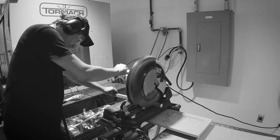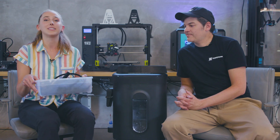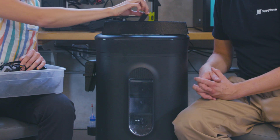As part of our work here at the lab, we produce a lot of prototypes, which means a lot of iterations along the way that may or may not get used. So we take our discarded 3D prints, predominantly PLA, a very common filament, and grind them down into finer shredded bits. We actually have some discarded prints here that we can give you a brief demo with this shredder that we've hacked — it's just a common credit card shredder that we've modified to make it a little easier to put more material in all at once.